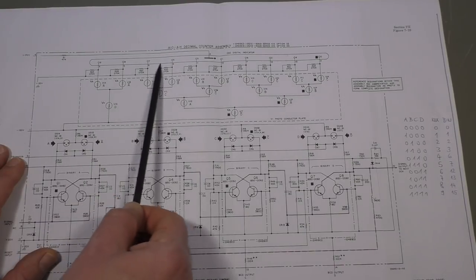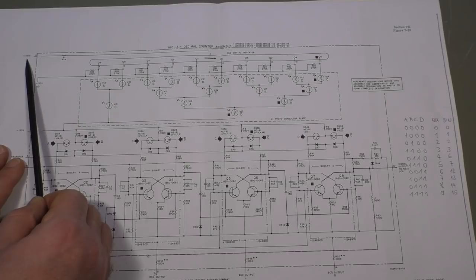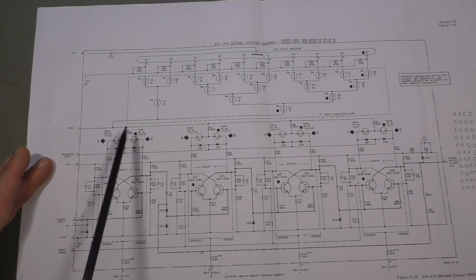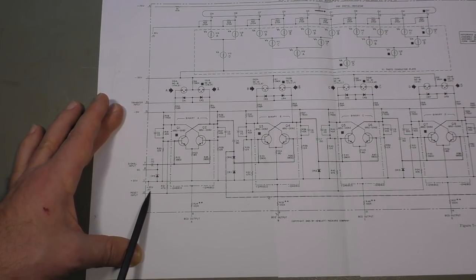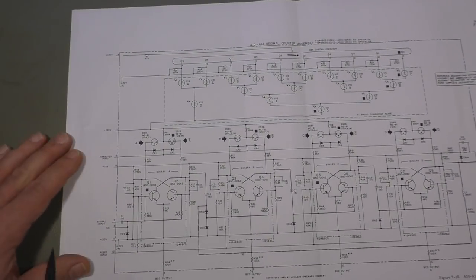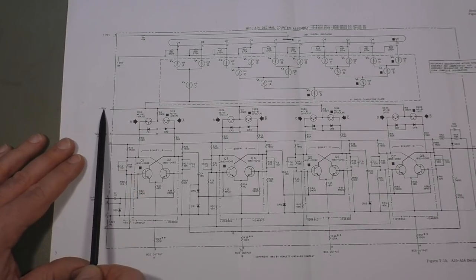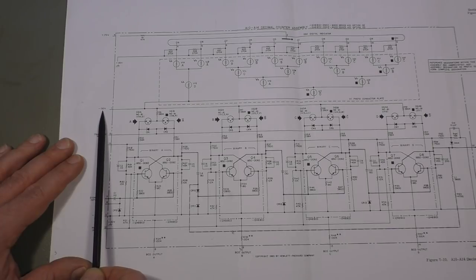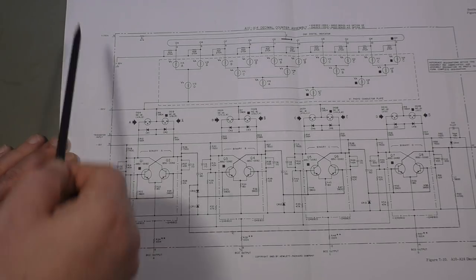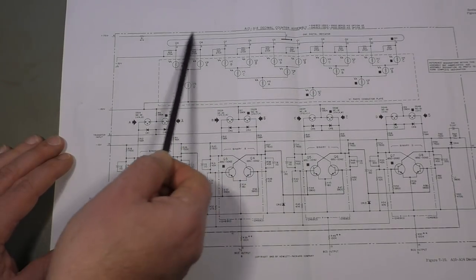So here on the top, that's the Nixie tube. It has a common anode here that goes to plus 170 volts. Funny fact, where is it? Here, for example, ground is at plus 20 volts. So that's not a 0 volt ground, they have a 20 volt ground for this module. And that means this voltage is effectively not 170 volt, but 150 volt. And the minus 130 is effectively minus 150 with respect to that ground here. So we have plus minus 150 volts. That's 300 volt across the whole decoder and Nixie tube circuit here.